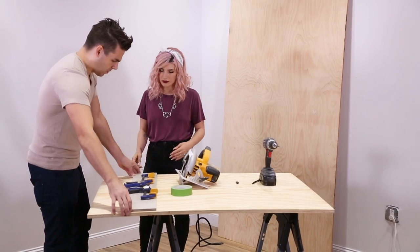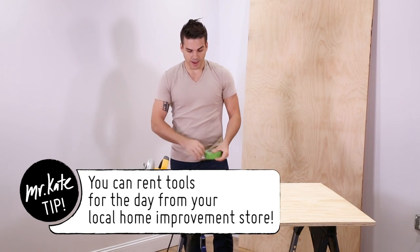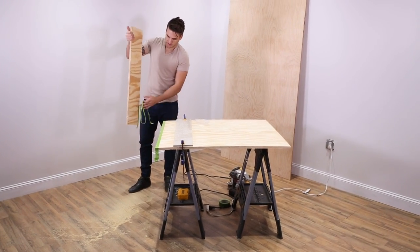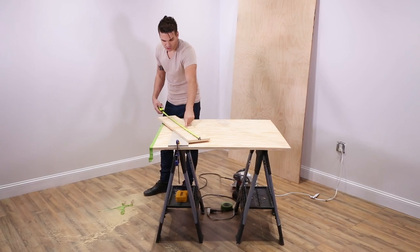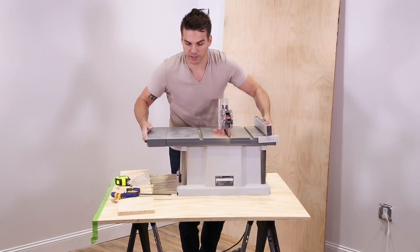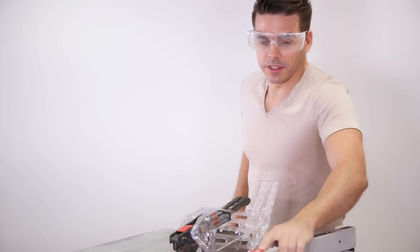It's going to look very raw! The shelves shouldn't be too wide — just where you put a glass of water, a book, and that's it. I've got my circular saw and then I have a piece of tile I'm using as my straight edge. Under my cut I'm going to use some tape, just to keep it from splintering too much. Safety goggles on! I got my shelf piece — three quarters of an inch. You just want to make sure it's thick enough because we're going to drive some screws in to keep it mounted. I'm going to make the shelves 14 inches each. If you don't have any saws or tools like this, the hardware store will totally cut things for you — you can just go in with your measurements. But I have the tools, so let's cut.